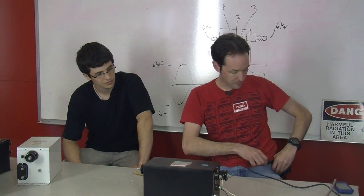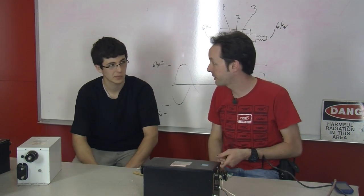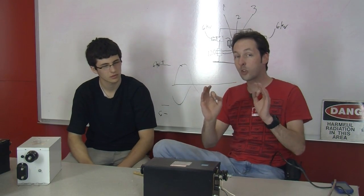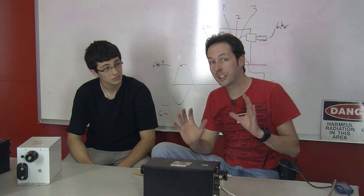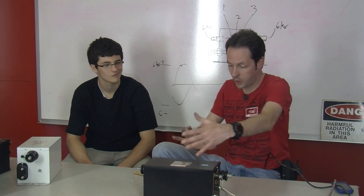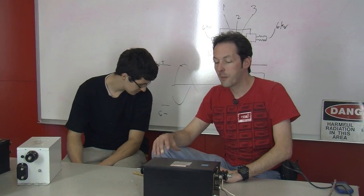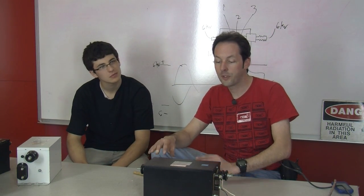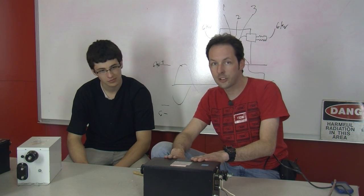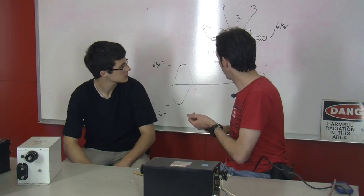So now we've covered the basics of neon sign transformers. Now the other things you need to know is they come in a bunch of different sizes. The Holy Grail is a cold cathode tube transformer. They're huge. They're big, beefy things, and they'll have power levels that'll go up to like 750 milliamps. They're just insane. They're also really rare and hard to find. What you really are looking for is a 15,000 volt, 60 milliamp transformer. So here, we'll write that down for the people at home.